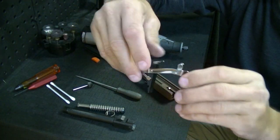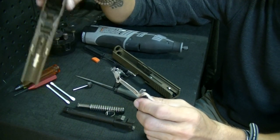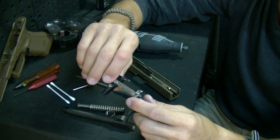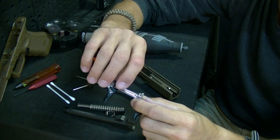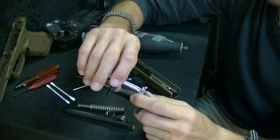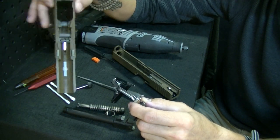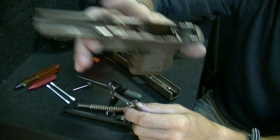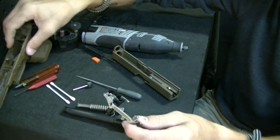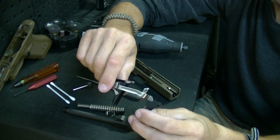This side of the transfer bar is what actually rubs up against the polymer. I usually put Gen 4 bars in all my kits — everyone asks why. Because of that dimple right here. The reality is they've been using this design in the bigger guns for the longest time. Metal on metal is a lot sleeker than hitting three pieces of polymer, and that was the design intent. On this Gen 4 gun, it's really not working that great with those three polymer pieces.